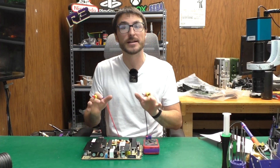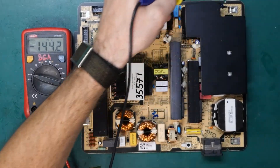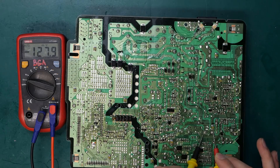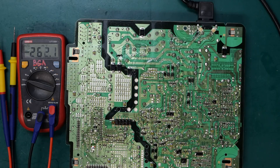So let's plug in the power supply and do some live DC voltage checks. My first check is going to be on the filter capacitors which are here under the heatsink. Let's flip the board over — over here are the two capacitor joints. Let's plug in the board. I didn't hear a click sound so let's do our checks.